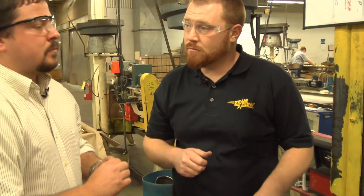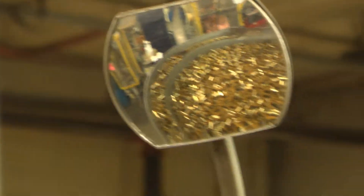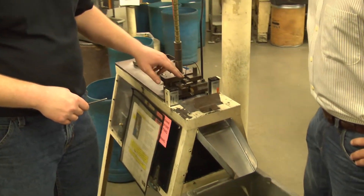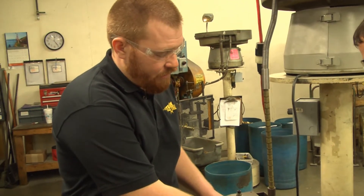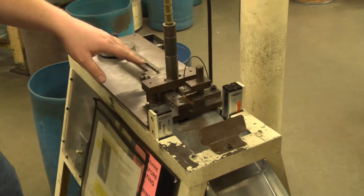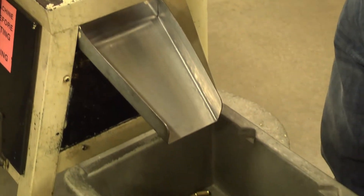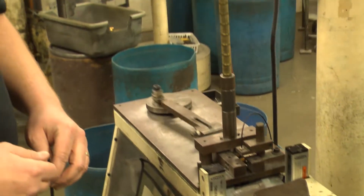From here, these cases are going to go to our finished inspection machine called the I. It's called the I because of this fiber optic cable — if it doesn't see a flash hole, it's hooked up to a magnetic brake that shuts the machine off, so they know they have a part without a flash hole. It's also set up with ball bearing detection on this arm — if a part comes through that's too long or too short, it'll kick out. It's a real high-level mechanical inspection.